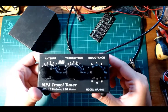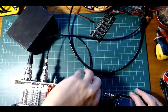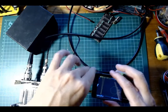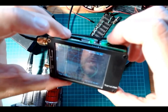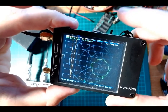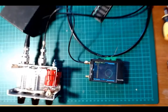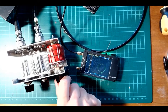This also shows the procedure recommended in the manual. I have the NanoVNA, so let me connect it to the transmitter port of the tuner — the NanoVNA is going to be our transmitter and can also measure SWR. At the moment it's tuning very well at about 5 MHz, but suppose my goal is to tune the 14 MHz band.